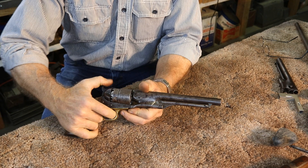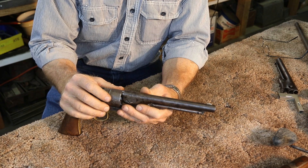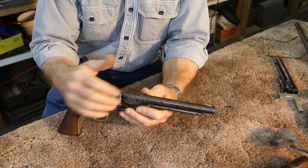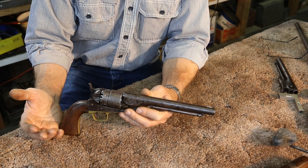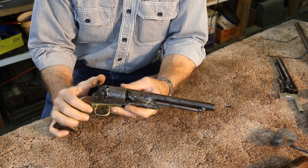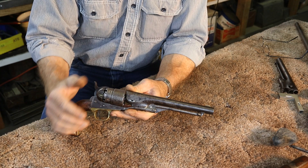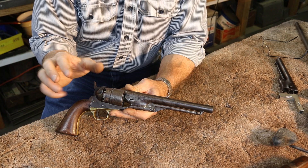I really like how it's set up. But the big problem we had was with the barrel-cylinder gap and the end shake — we had about 35 thousandths barrel-cylinder gap, and the cylinder could just bounce back and forth. There's a lively debate about how much barrel-cylinder gap there should be in these old revolvers. Some people say they should be fairly tight, three to five thousandths. Some say they've got to be a lot looser — eight to ten to twelve thousandths — because if you get them too tight, fouling will prevent the cylinder from rotating. I kind of split the difference and set it up at roughly five to seven thousandths.